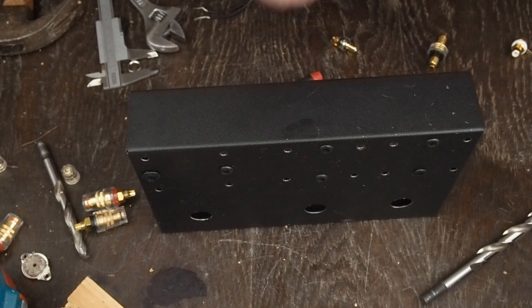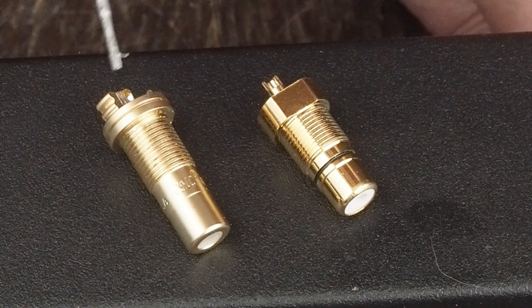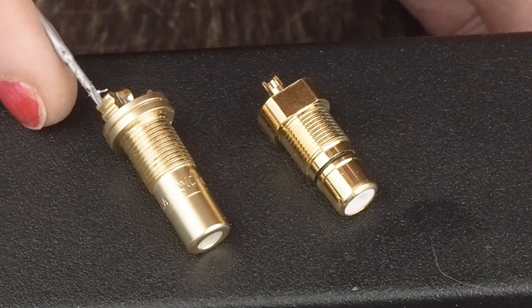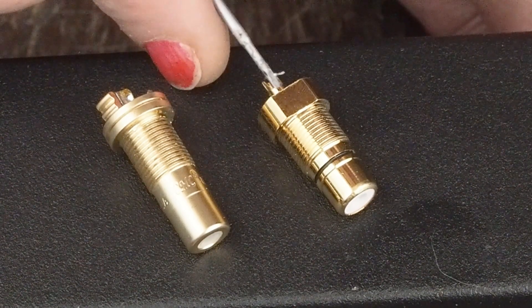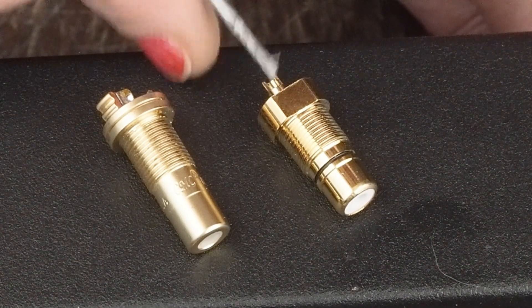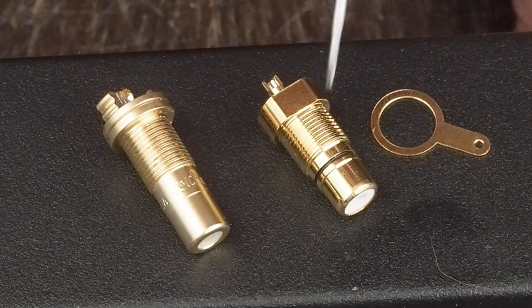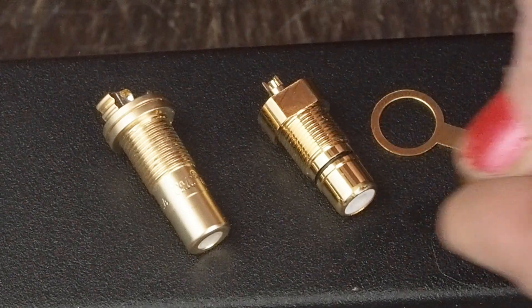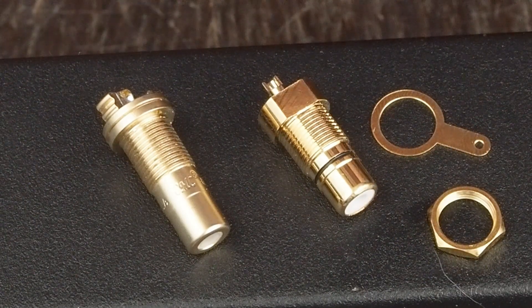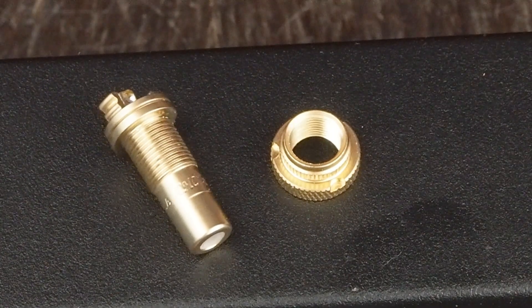The other thing I wanted to show you is the difference between a quality and a cheap RCA jack. On the good ones you're soldering to the actual body of the jack for the ground and then to the center lug. On the cheap ones you can't solder to the body because there's too much mass, and it ends up melting the plastic insulating the inner and outer shell. So you have to use these little cheesy solder tabs for the ground that require a mechanical connection — to me that's just not as good. These also have a cheap-looking nut. The nicer one has a much better nut; it's a lot nicer product and not that much more expensive, so I highly recommend using these types of RCA jacks.